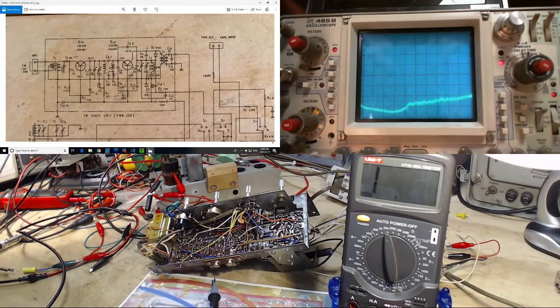Stay on the topic. So, I could read the voltage across this capacitor, C63. The real difficulty here is identifying these components. It's virtually impossible in there. So what if I put my ohm meter on this lead and then try to... I can put it down here. That's essentially what I've done. That gives me the 7,000 ohms.